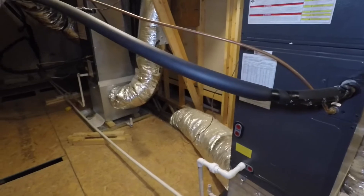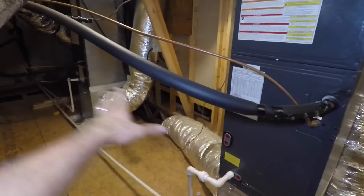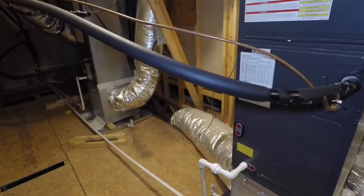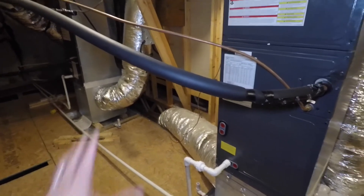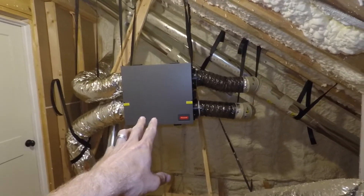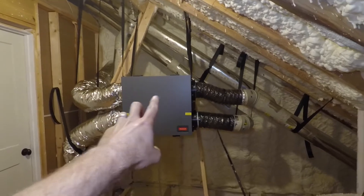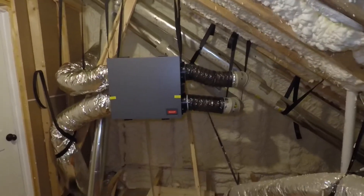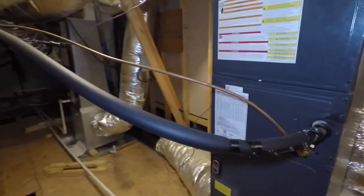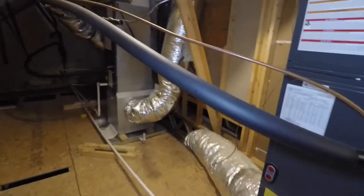Hopefully that's making sense. I basically wanted an independent system. I don't want these HVAC units, which use a lot of energy and run up the power bill quite a bit, to run every time the ERV runs. This ERV is only drawing about 1.4 amps — it's got two DC motors in there and uses very little power. These big HVAC units are really sucking the juice down, using a whole lot of energy. They're probably one of the biggest factors in my power bills.